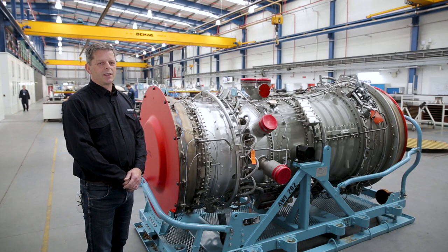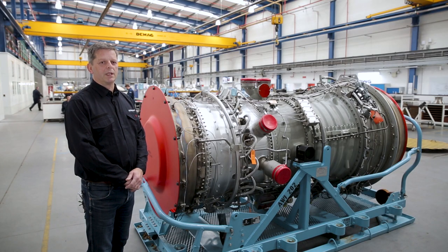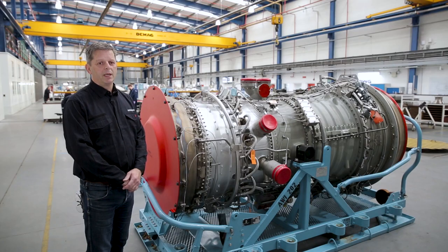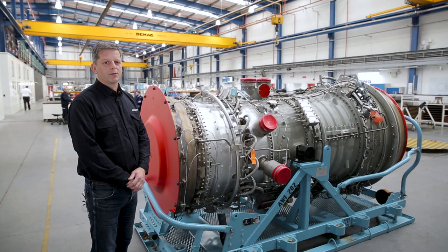Recently Siemens has observed gas turbines arriving at the overhaul facility with damaged components or corrosion of the gas washed surfaces. This is primarily due to poor preparation of the gas turbine before removal from berth, inadequate shipping protection or poor storage equipment. In one instance, the corrosion of the gas washed surfaces was so extensive that the additional material replacement bill was over £600,000.